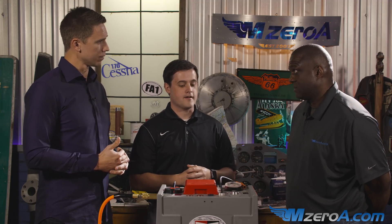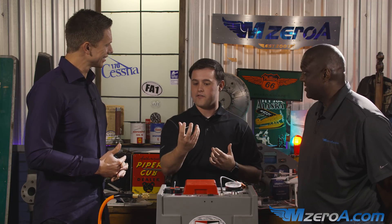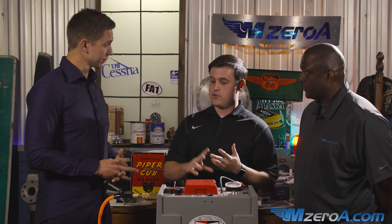Just taking it from the top to the bottom is not going to give you even wear. There's actually three main reasons that you rotate plugs. Top to bottom — because we talked about in the last video about gravity and how the bottom plugs get oil fouled. So that's reason number one. But a more important reason — the big picture is you're looking for even wear of the spark plugs.